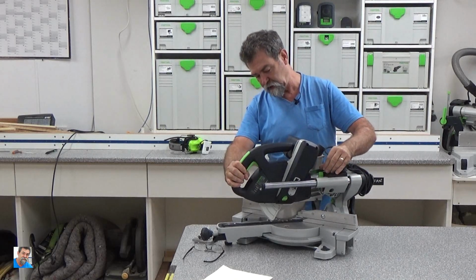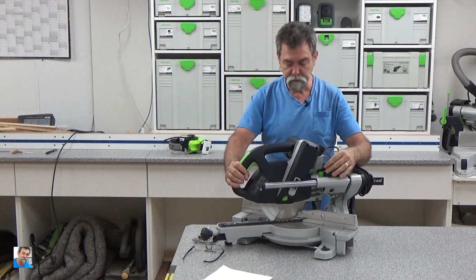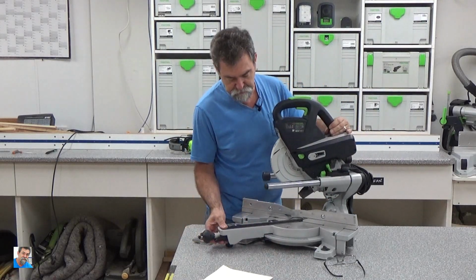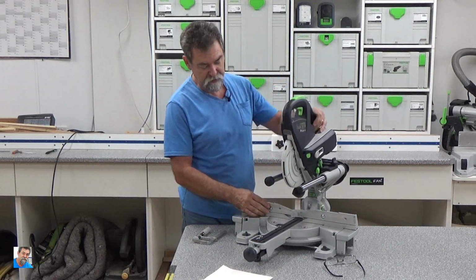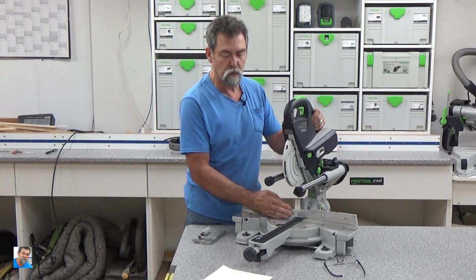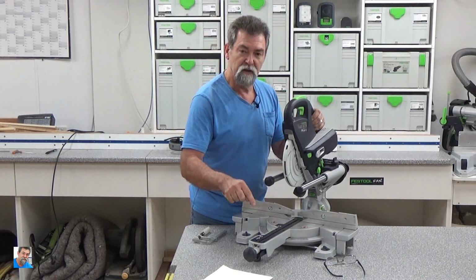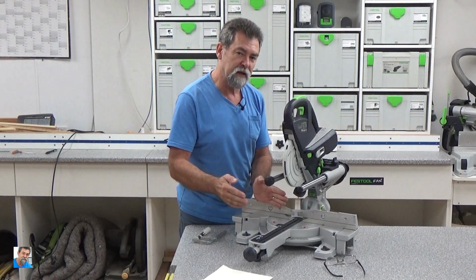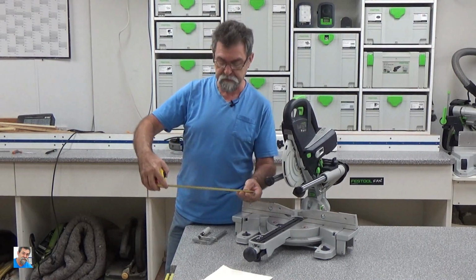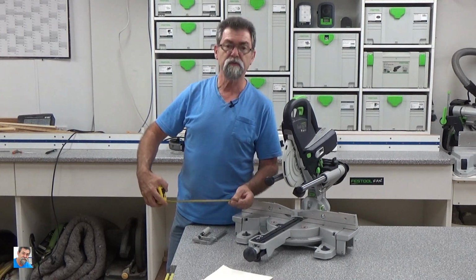I can adjust it. You can see it dropping down there. You can stop it when it gets to the point where the teeth are just inside the table. The trade-off of that, of course, at 90 degrees, or at any degree really, is that the cut won't complete at the back unless you put a sacrificial fence of some sort to space the timber forwards. If you bring the timber forwards, the cut isn't going to be as wide anymore. So you're going to come down to approximately 270 millimeters. 270 is about 10.5 inches, and 68 is approximately 2 5/8 of an inch.